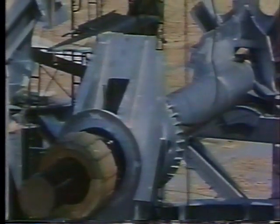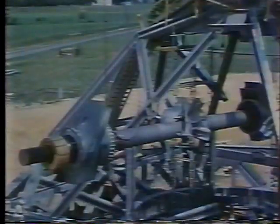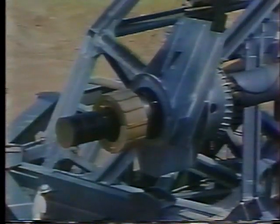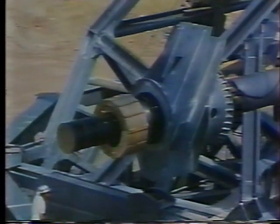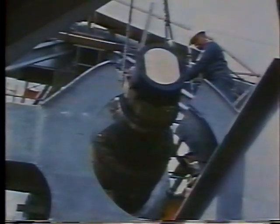The declination shaft is one of the most complex subassemblies in the telescope. Its aluminum shell is adjustable about a steel central shaft. The quill assembly allows the antenna system to be precisely adjusted to the true declination axis. The steel shaft is adjustable so as to bring the declination axis precisely perpendicular to the polar axis.